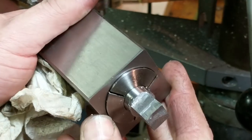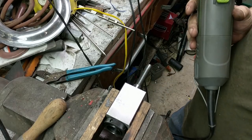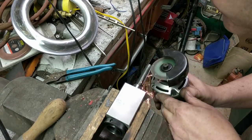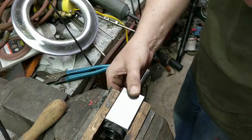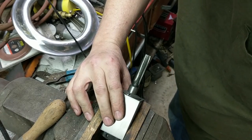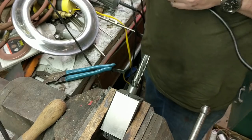Now we have the square shank on the end. If you're a real machinist you use a ball end mill and a square collet block in the mill to cut hemispherical-shaped grooves, but the truth is all you need is any sharp edge groove — so we're going to use a cut-off wheel. The collet block just gives us a good idea of where square is. Then we'll use a Dremel tool at an angle to grind a relief — the cutting edge is contacting the part and the rest of it is not. You really only need to do it on the first four or five threads.